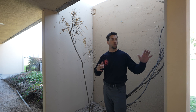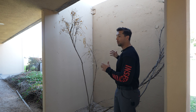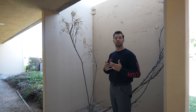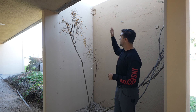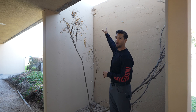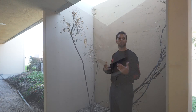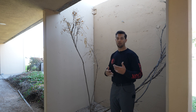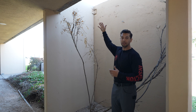We're going to think of these walls and panels as a system. All these panels are individual, but when tilted up and put in place they're connected and secured together to create an entire exterior watertight system. They have to be bracketed and sealed together. In this case we have an exposed bracket — this is a welded bracket, though you could also have a bolted bracket. These aren't always visible or accessible to the inspector.